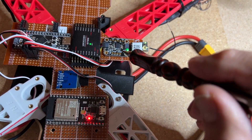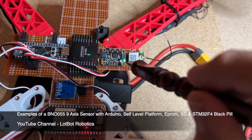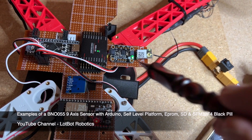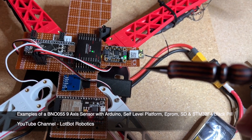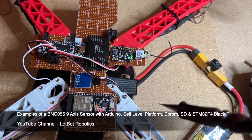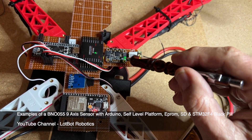Over here is the BNO055 — that's a sensor that actually contains three sensors: an accelerometer, a magnetometer, and a gyroscope. It's not working right now, but it's going to be passing data to the STM32F411. When the motors send the drone to a point in airspace, you have enough power to get it there, but don't forget there are other effects such as gravity and wind. You need some way of sensing where the drone is — not just getting it to a point, but making sure where it is and what effects are acting on it. This sensor will give you that kind of information.